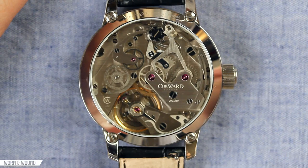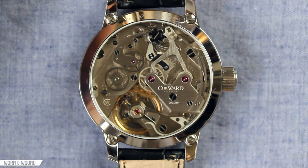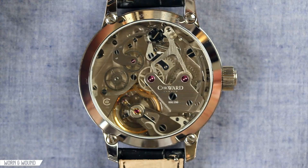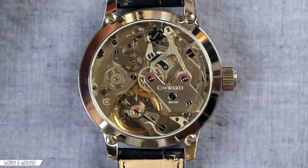When you start the chronograph, you can see various levers and gears kick into place, which for the price point and for a brand that usually sells to a certain market, speaks to what they want to do — bringing this level of watchmaking to the masses. The chronograph movement itself is a column wheel chronograph. You can see the column wheel here, often referred to as having a castle turret-like shape.